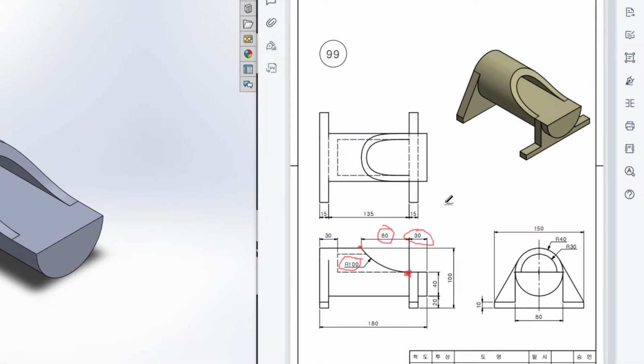After that, in here we can see in the back face. In the back face we have another extrude boss here, and for this extrude boss portion, first I will have to draw this line, and this line is 150 unit, and then I'll draw one vertical line of 10 unit and another vertical line here of 10 unit. Then I will draw two tangent lines from both sides.